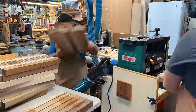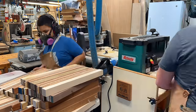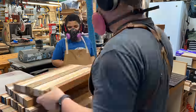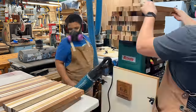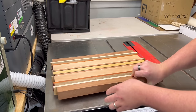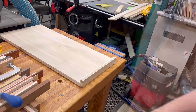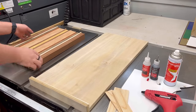For flattening, a planer is your best friend. If it's relatively flat, run it through the planer a couple times on one side, then do skip planing — rotating the board back and forth to get it as dead flat as possible. You could also use a wide jointer, drum sander, CNC, or router sled with a large bit. One thing to note: a week after surfacing those boards, one was super wobbly. After gluing up, let them sit for a bit because of wood movement — they may warp or twist slightly.